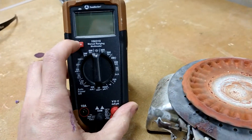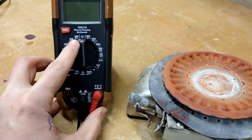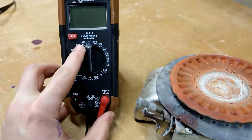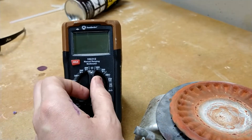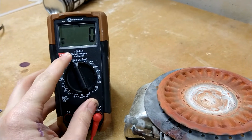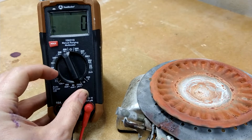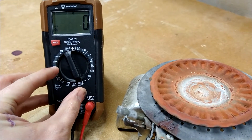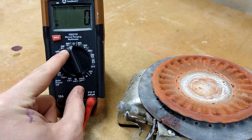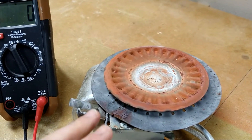The manual says you should get 300 millivolts of DC power from this. If you have a manual multimeter, you'll want to set the range to the lowest voltage setting — around 2 volts — to capture that 300 millivolts reading. That's while you're applying a flame to the thermocouple.